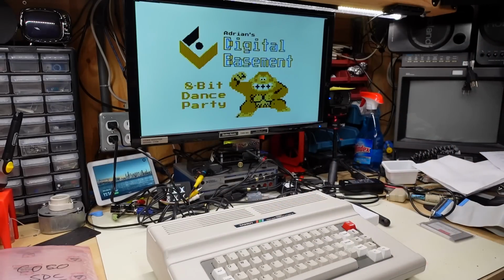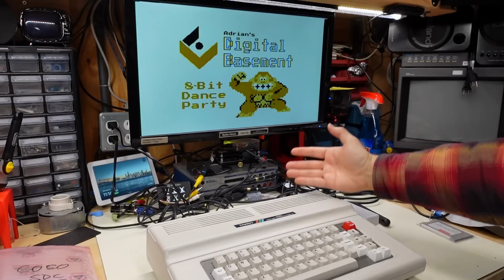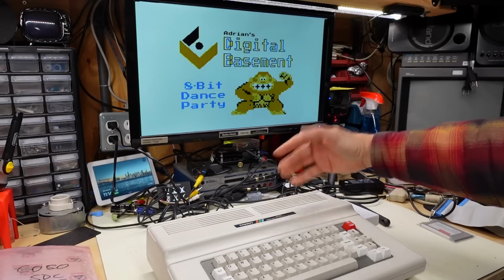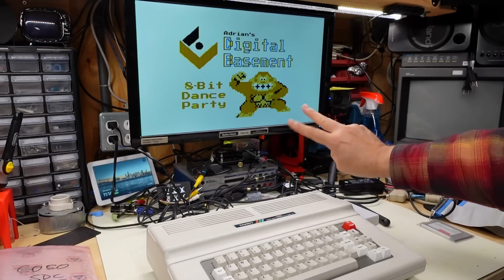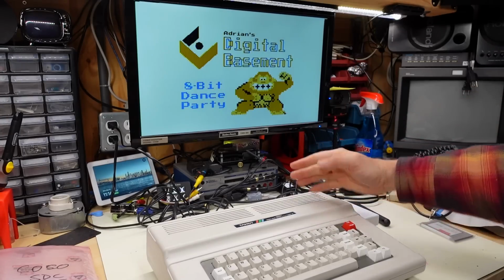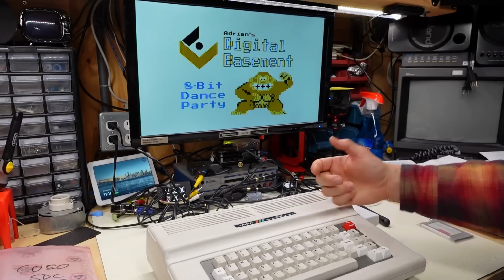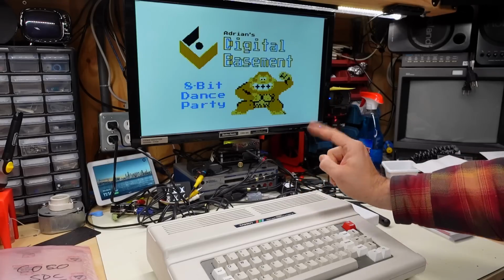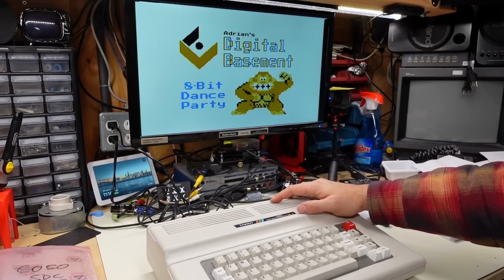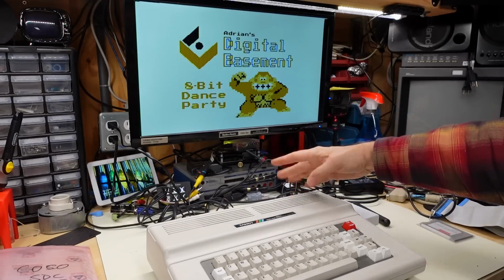All right, well, obviously the sound capabilities on the Coco are not up to the same level as on the SID. There's actually a very primitive 6-bit DAC, digital audio converter, in here. If you noticed, it was actually playing multi-channel audio there, I think 2 channels. This was made off of a MIDI file. So it's possible for a machine like this to play full-on digital music, multi-channel, good sounding stuff. But the difference, compared to the 64, is that it requires all or most of the CPU's power. There's only enough CPU power left to do this very simple animation while the music is playing.